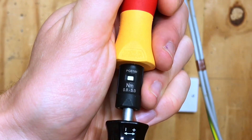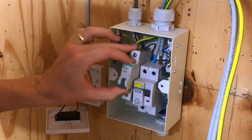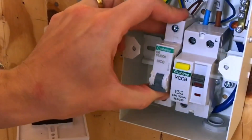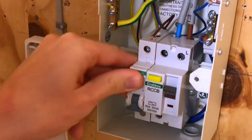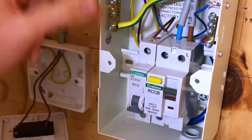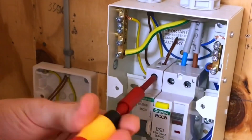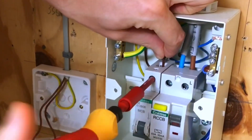We're going to set up our MCB to the right tightness. It's the star breaker design, which is the push-fit type connection — really nice. We just hook that over the top of the breaker, top of the busbar, and then push it at the bottom. If you're having to absolutely force that home, you haven't got that blade lined up correctly. Then we'll just pop the conductor in there,